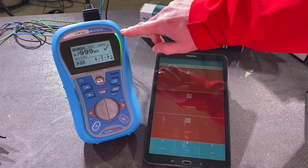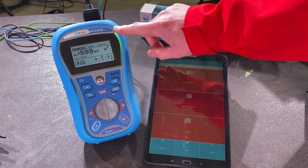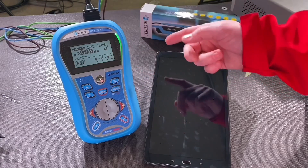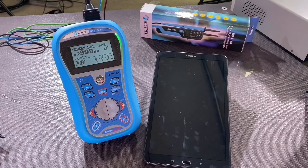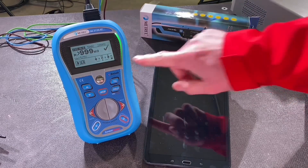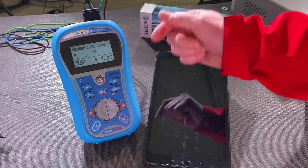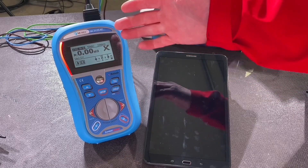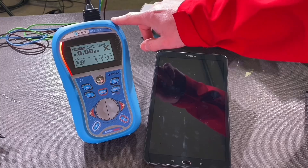You've also got a green illumination here, meaning the test just carried out — in this case insulation resistance — was correct. If you carry out a similar test where the results failed, you'd see a red indicator light instead. Let's press the button and see — the insulation resistance test has been carried out and we get a red light, showing the results have failed for that test.